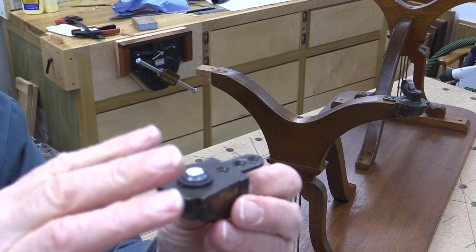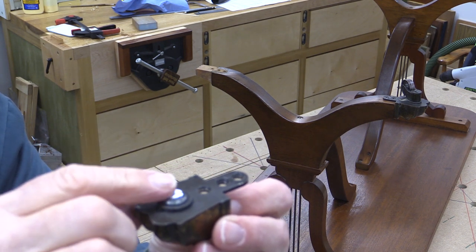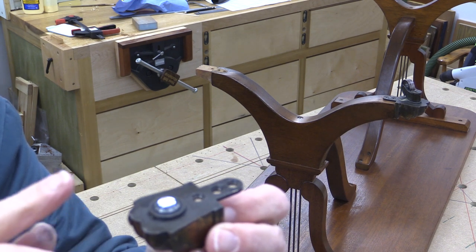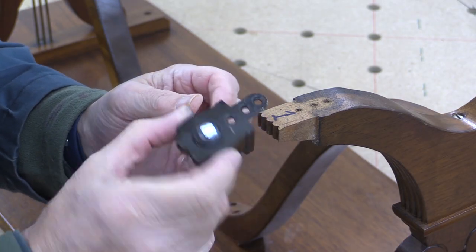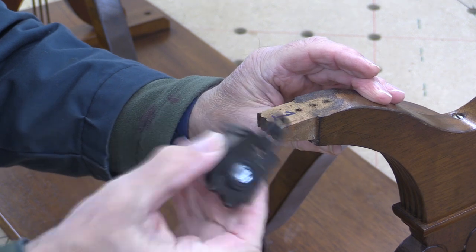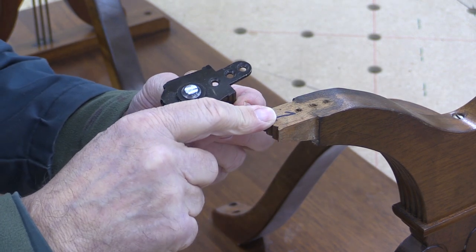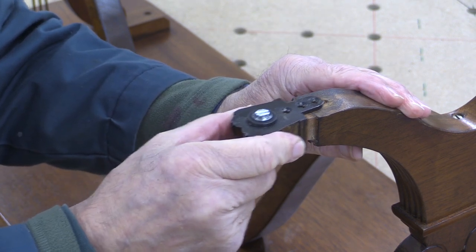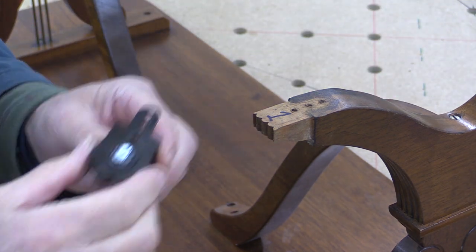Well, what I'm going to do is I'm going to put pads on here, and this bit that sticks up here will be in a recess in the solid mahogany pad. Just to be on the safe side, in case these are made to fit, I'm numbering them. I've scratched the number one there, I've written a number one there. So I know this one's got to go back in that position. I'm now going to take all the others off and get them to this stage.